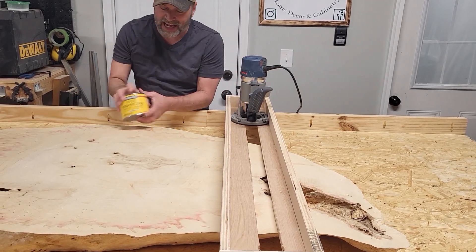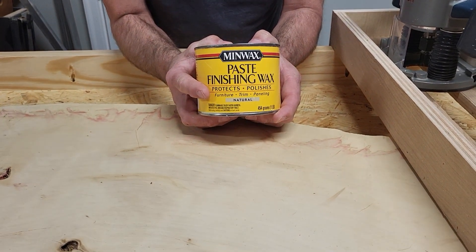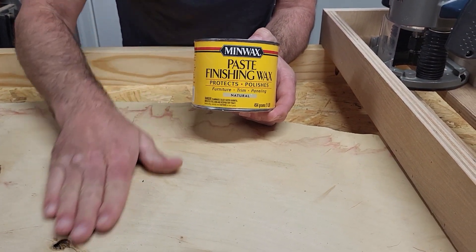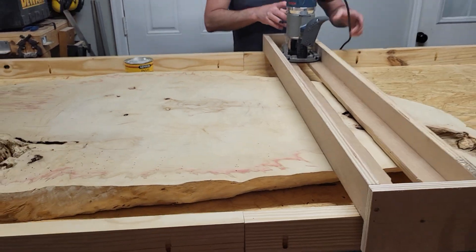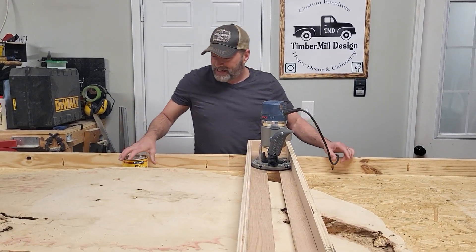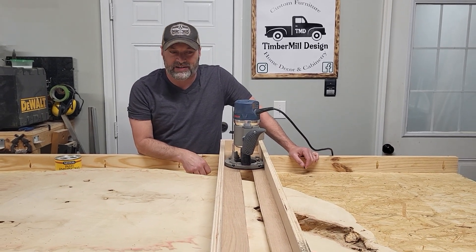What's going to make it slide even better? We're about to wax it down. This is what I put on all of my tools, on my table saw, and it allows things to slide a little bit better. We're about to wax the inside of this and it will allow it to slide even easier back and forth. We were needing a flattening jig and we built it ourselves right here.